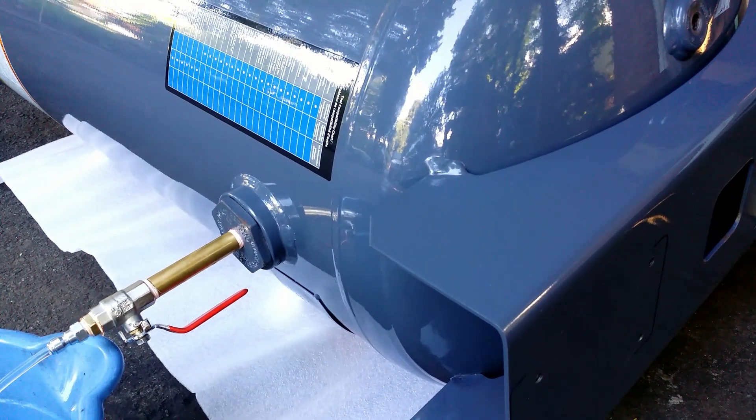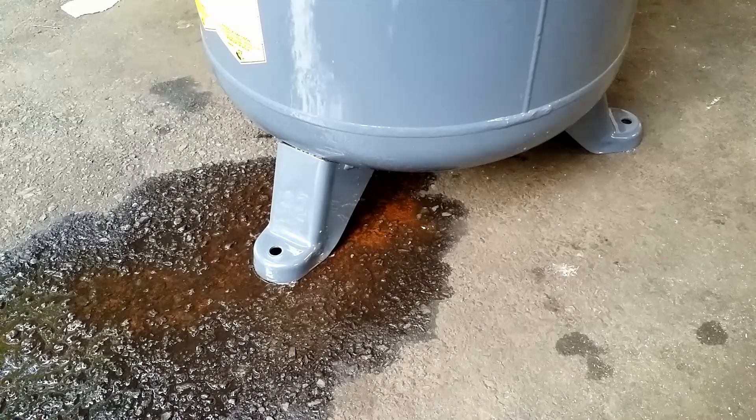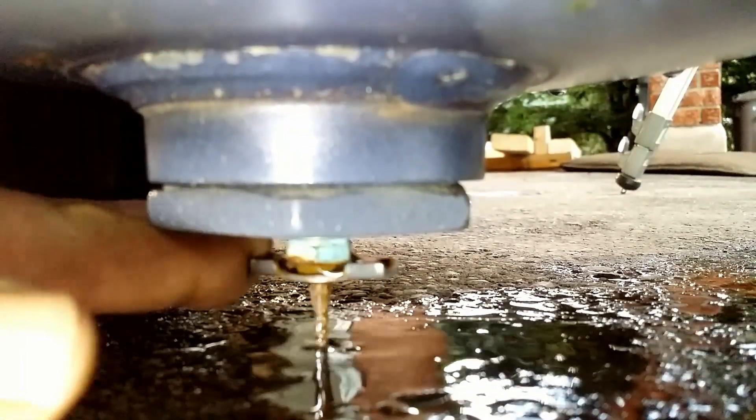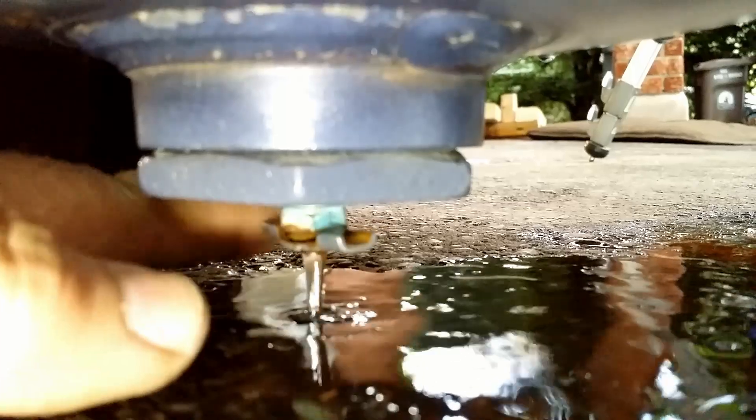This water is used to water flowers. The tank is standing now and the remaining liquid — yes, it is no longer water but liquid rust — is drained. Rust buildup clogs the drain. In service it is better to drain it with some residual pressure to purge the valve.